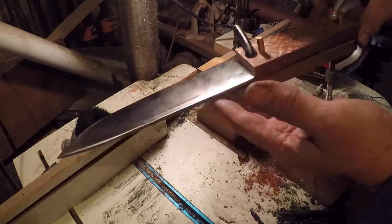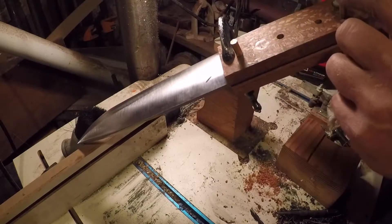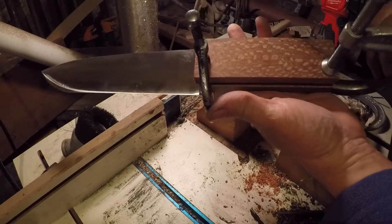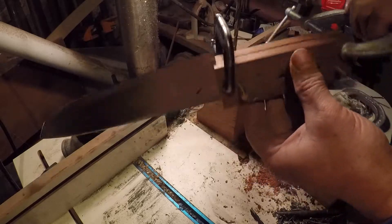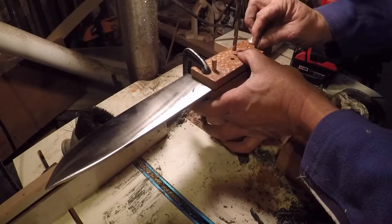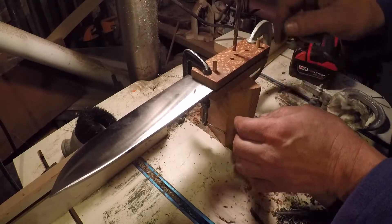To save some time, I already put the piece I drilled with two pins into the holes so they aligned, and I clamped the second piece right on the other side. Now to assure that they will go tight to the other side — now I can move the pins. It's clamped and drill through.